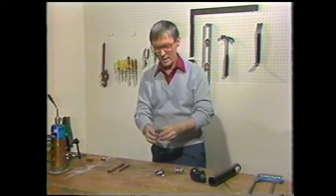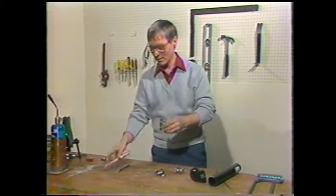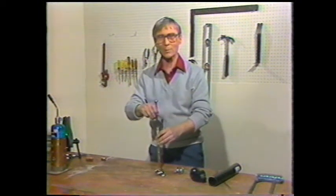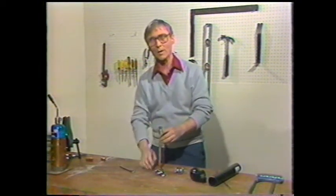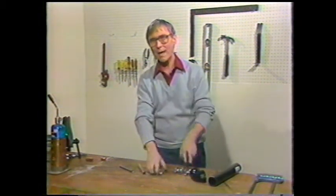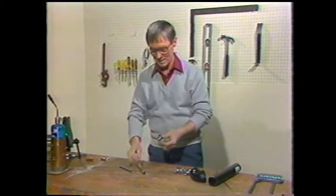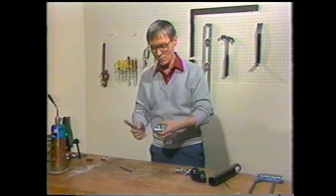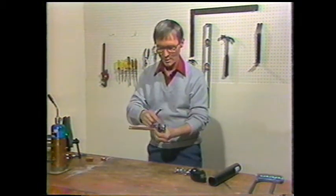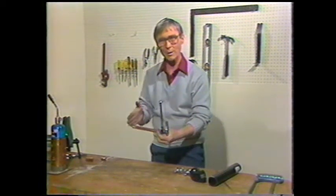The straight-ahead valve that we used had a pressure nut on one end for the copper pipe, and it had a pressure nut on the other end for the supply tube. Again, this is where the water line is coming out of the floor. If your water line happens to come out of the wall, you'll need a right-angled valve. And this particular one, you solder the pipe in, and it has a pressure nut here for the supply tube. So you can see the water coming out of the wall.